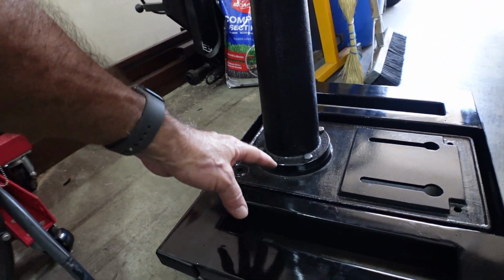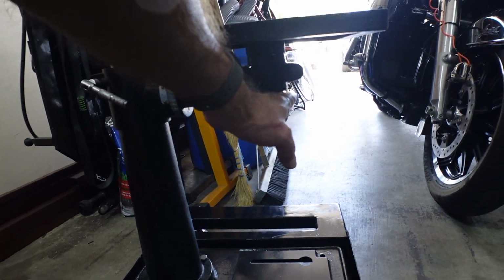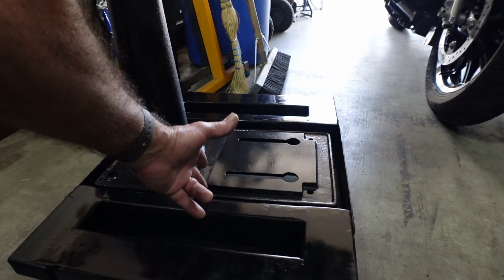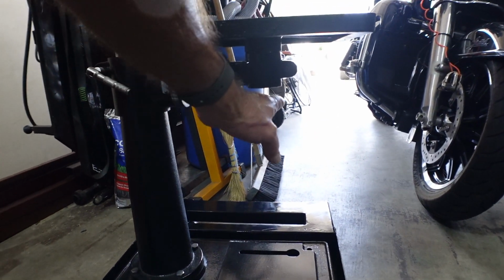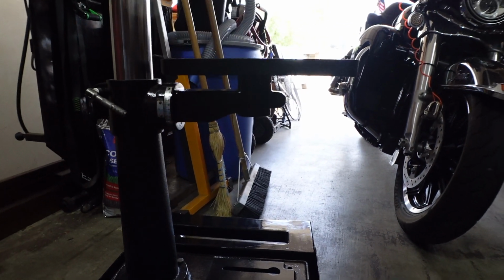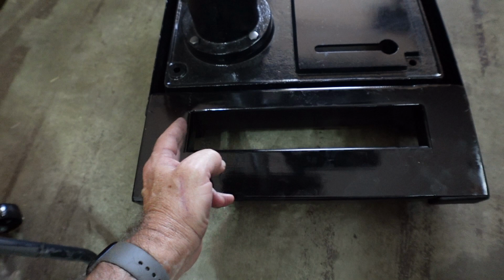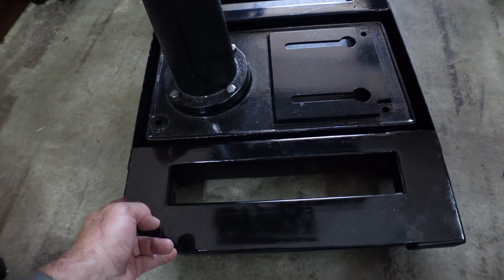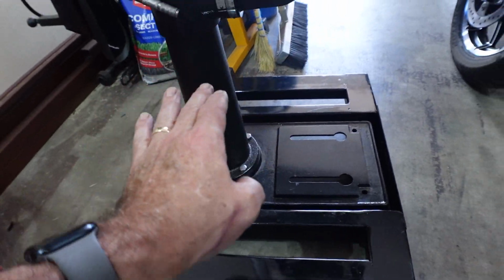So I'm going to have a corner cabinet that comes up here to this level, which is 15 inches right under here. This cabinet comes back 10 inches across here and runs all the way across. That's my front cabinet. It's going to have shelves and whatnot. It's going to come right up to underneath here, which is right at 15 inches to the bottom of this. That leaves me about 10 inches over from here. The space I can use for that is 9 3/4 wide, 7.5 deep, and I'm also coming up to 15 inches on this side.